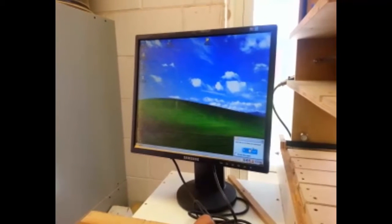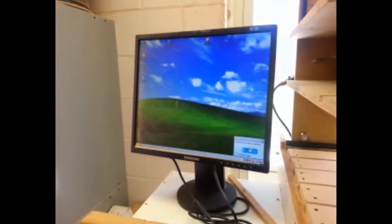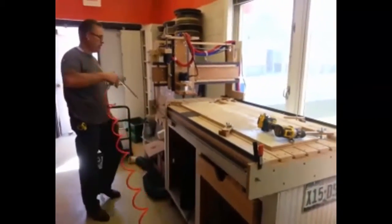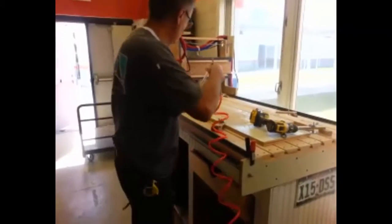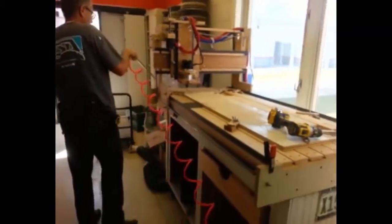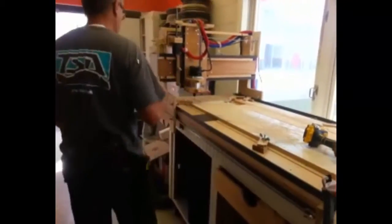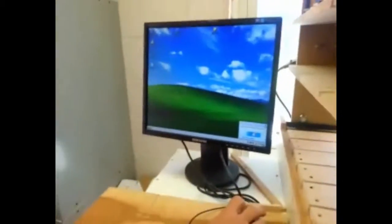The way I run this machine, I'll come down here to my start menu. But first, let me take care of one step real quick — it's very important that you always blow off your machine after you use it each time. I'm going to take my air nozzle and blow off the table to get it clean and set. Now we're cleaned up and ready to go. I'm going to go ahead and open up the Mach 3 software.